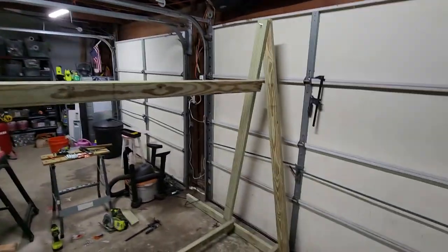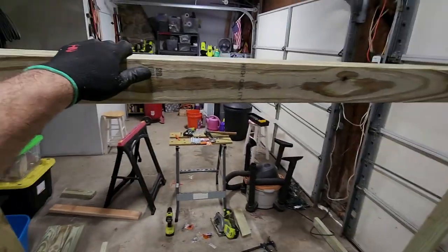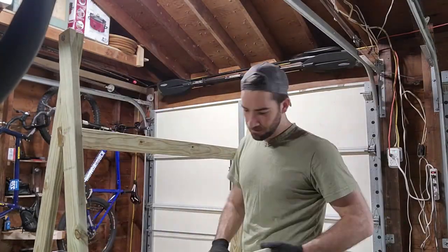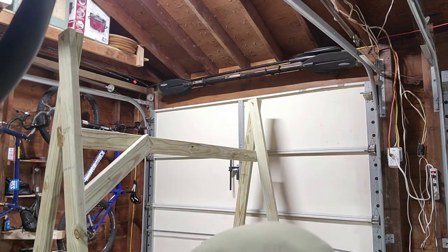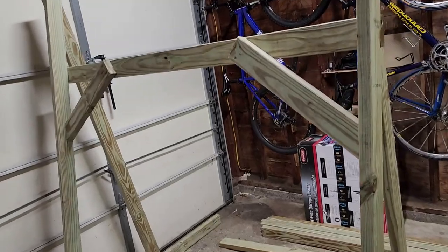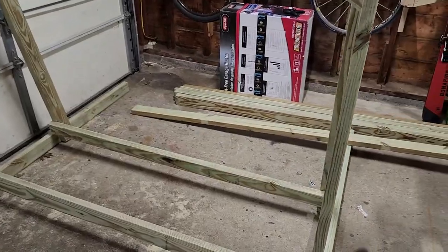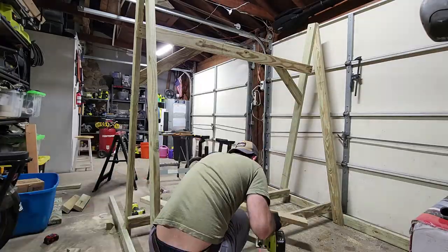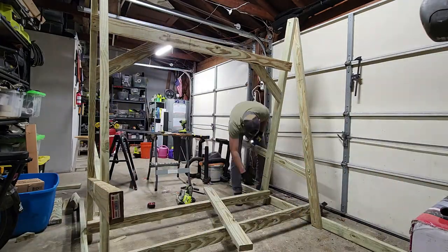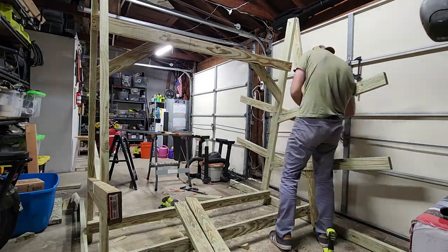This is where I'm at so far. I've got the frame freestanding. I'm going to put some angle braces here just to get rid of the lateral movement, and then slap the arms on. The first thing I did was make sure each side of the frame was level, then I cut approximately two-foot angle braces. One side has a slight angle cut into it so it sits flush up against the A-frame; the other side overlaps the top beam with three screws. I took out a lot of the lateral movement with these cross-beams. On the load-bearing side of the arm, I through-bolted the arm through the A-frame, and the opposite side had a very slight angle cut into it. It sat flush up against the opposite side of the A-frame, and I screwed it in with two screws.